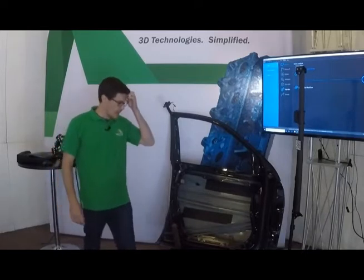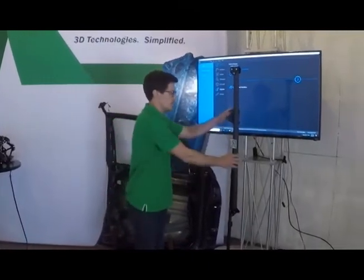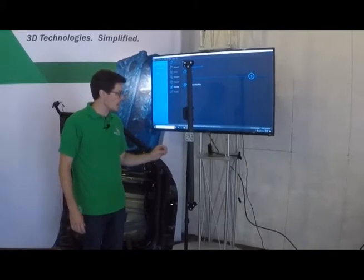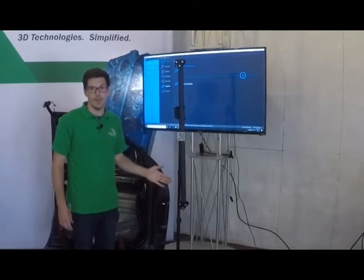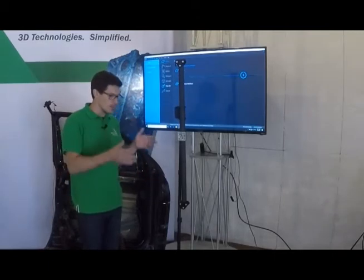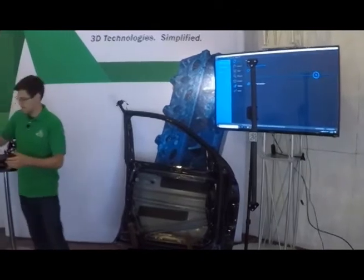The new thing I was looking at was a stand for the calibration bar. This is going to be a neat feature — while the system is warming up, we can actually place the calibration bar in the scanning volume and skip that warmup time entirely. This calibration monument, as long as it's live in the volume, lets us start scanning immediately and maintain all the accuracies and settings.